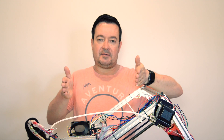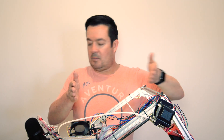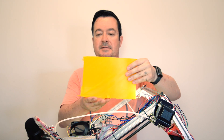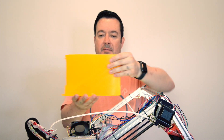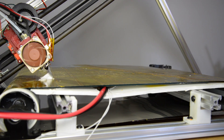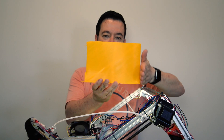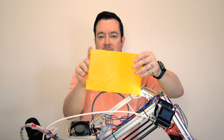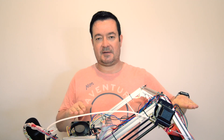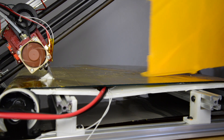My glass is around 300 millimeters long — the mirror I'm using as my print surface. I would make it longer. When I was trying to print airplane wings from 3D Print Lab, it was going along nicely but towards the end it dropped a little bit on one side before it even got to the end of the bed. The glass just ends and it starts drooping, so that corner comes out badly. I'd suggest making your glass longer so you have a long flat surface, and it will also help with the roller alignment.